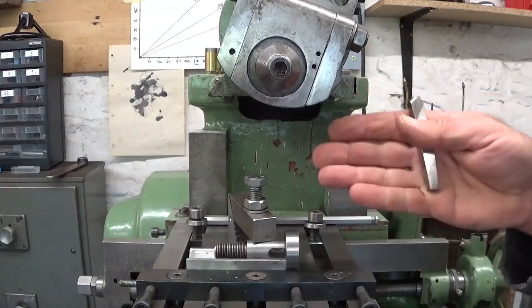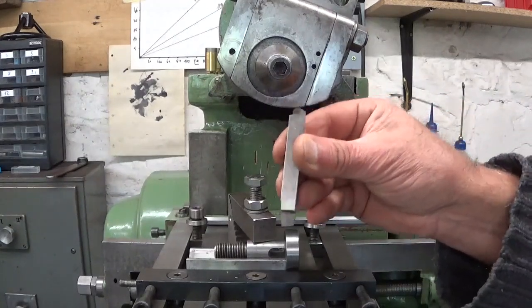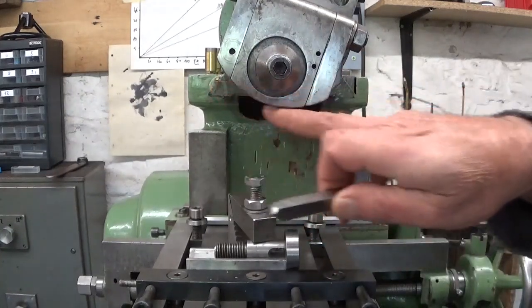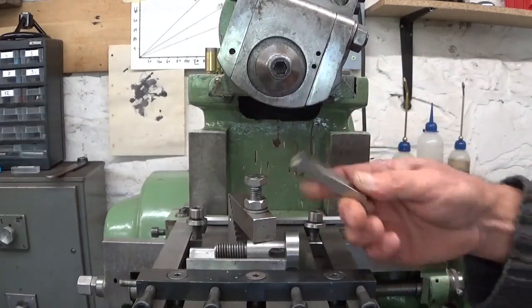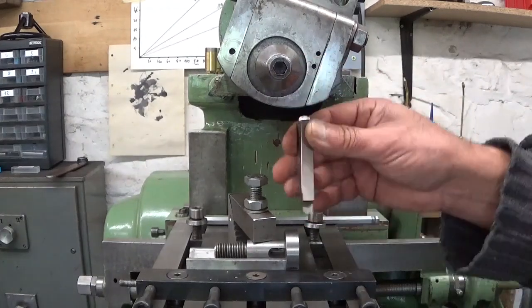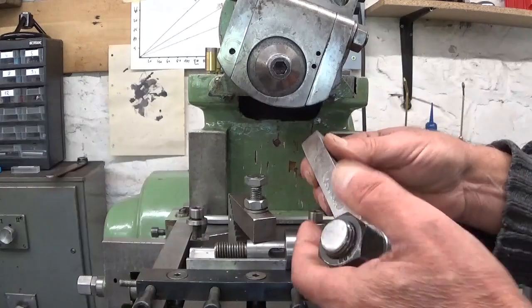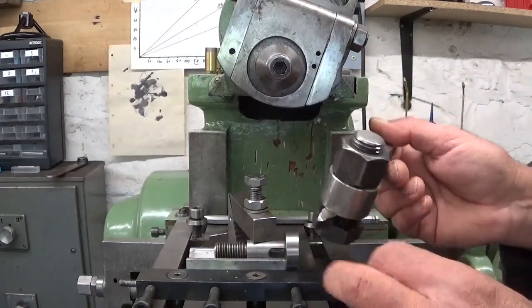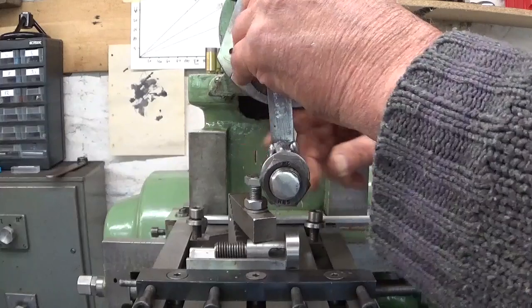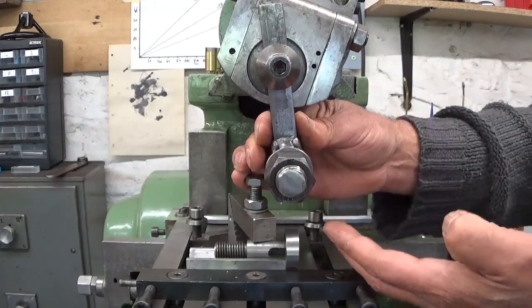This is, I think, a very nice example where we're gonna use the extended tool holder. If I want to use this cutting tool and I install it directly here, the underside of the clapper will touch the bolt, and of course there's not enough reach. And if I want to cut this directly in here, there will be so much tool stick out that is not rigid enough. So I installed another kind of cutting tool that I can cut in both directions, and this thing comes in here. Of course I have to install it the way it should be, but I'm sure you get the idea.